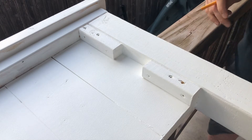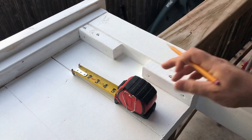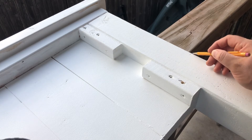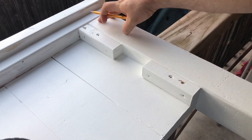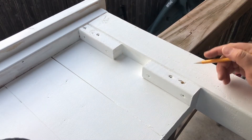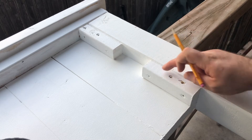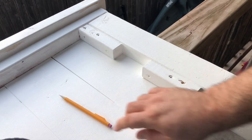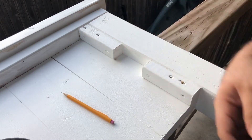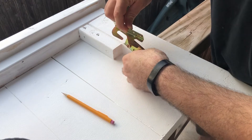That's five-eighths, so this is going to be the bottom. Since I changed plans, my mattress is 9 inches, my 2x4, and the five-eighths inch for the slat board — to keep all that in play I had to come down to right here. What that means is I have to take this out and cut it out. The original plan was to put the 2x4 in here and just drill it in, but I want something that's more secure, that's going to last forever. So what I'm going to do is put these brackets in here.